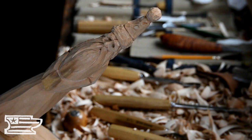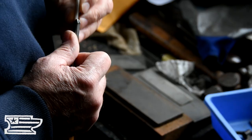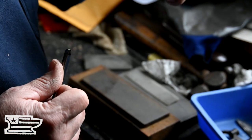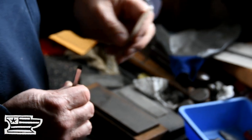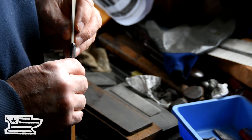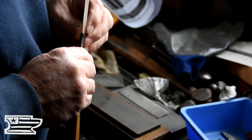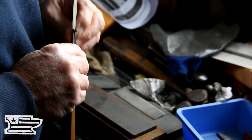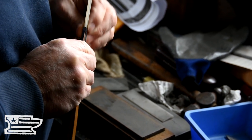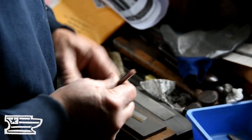I've got to work on this tool — it's not doing what I want right now. What kind of stone is that? It's a really fine V-stone. It's a diamond shape, but it's not a diamond stone. It's a hard white Arkansas stone in a diamond configuration. I just use it to dress V-tools. That's what it's for.